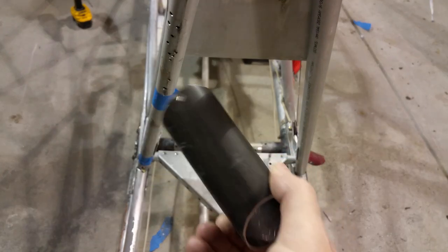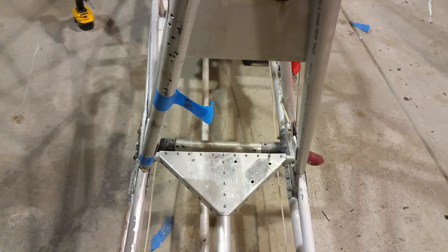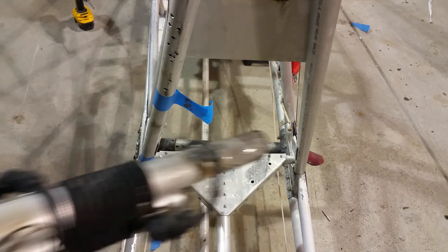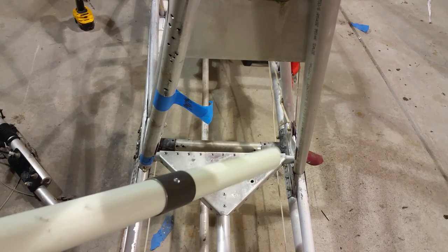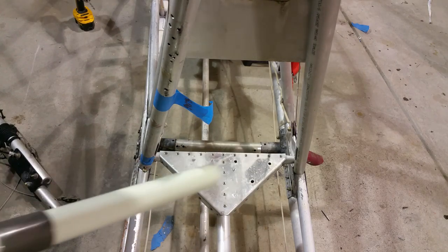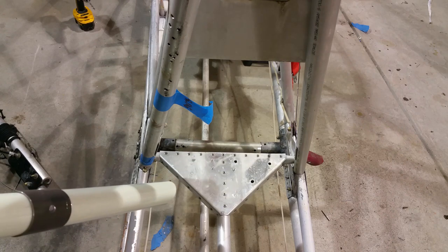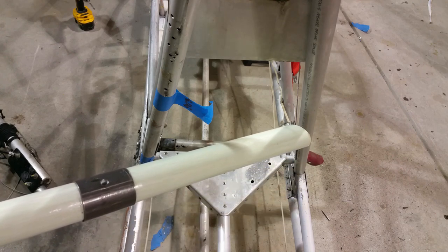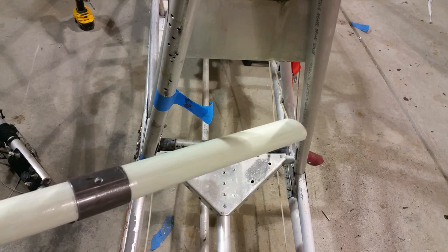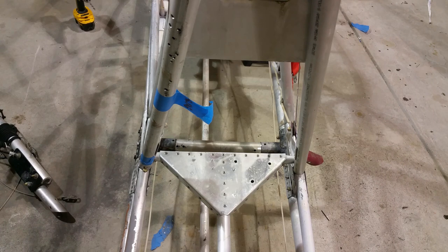So I have fabricated my replacement weldment. Now, before I put that on, I want to show you this. This is the old gear you've seen before. Replacing it with a fiberglass gear. Just weighed it, and just on the mains, it saves 1 pound per side, so 2 pounds total. I've heard a lot of good things about these being significantly more durable. The big thing is I got this as part of the kit from UFlyIt, and also upgraded to hydraulic brakes. I've compared the weights. I measured my weights, my setup, and compared it to theirs, the weight they gave me, and it's about 10 pounds off the airplane.